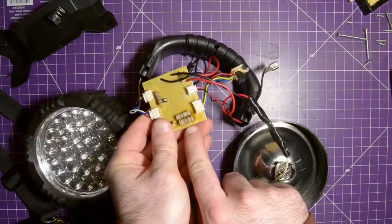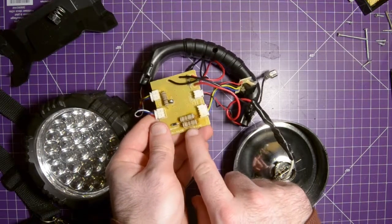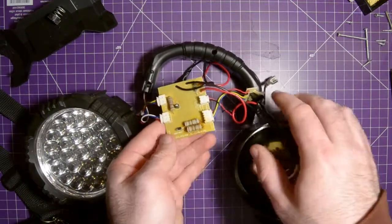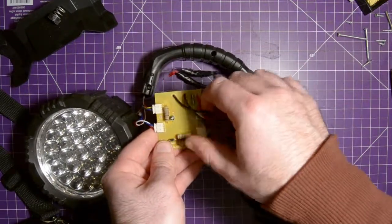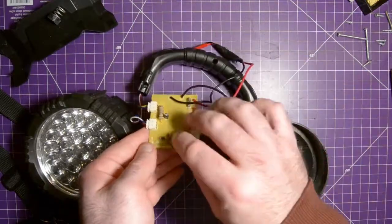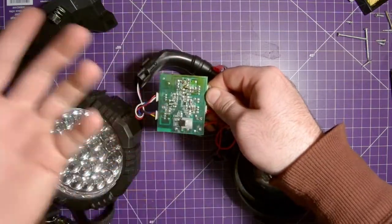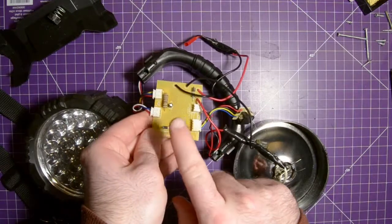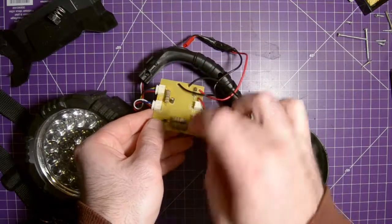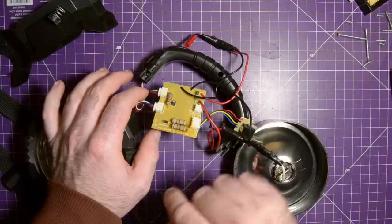And you see how this says 1178-fuse? I think they were trying to say that if these resistors got too hot, they should burst open and the battery would be saved, because there is another fuse here from the battery. So it looks like these did get hot. That's what's scorched on the board, and this is probably what melted the case, or almost melted the case. And if I feel them, they feel really chalky, as if the coating has been toasted off or something.